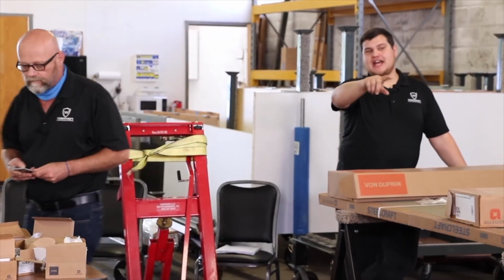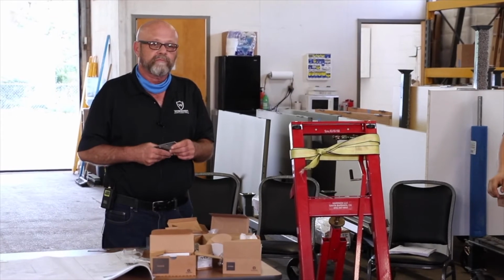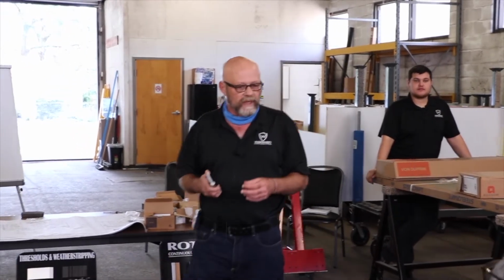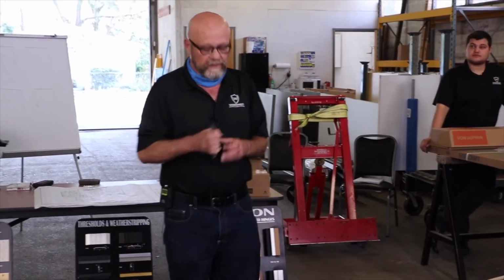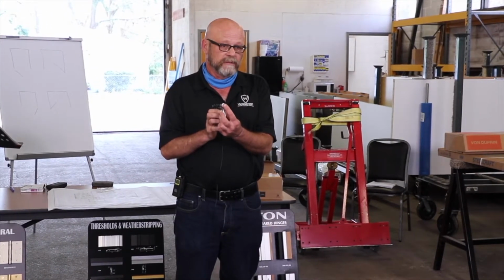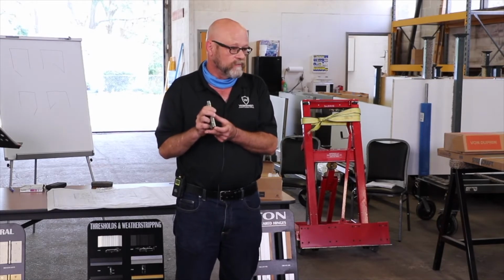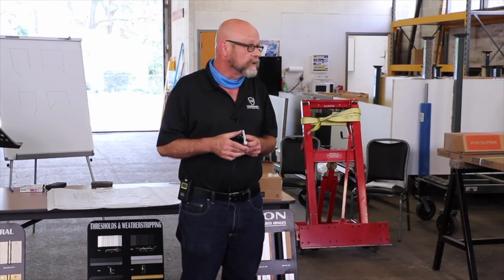And also that heavyweight hinge that you have is NRP also. It's a non-removable pin. There'll be a set screw in one of them if you open it up. Yes. You tighten that up and it keeps you from taking a screwdriver or a punch and driving the hinge pin out. I myself have tried and I've never been fortunate enough to get a door out with all the pins removed. They say, well, you know, you can break in, but I spent an hour and still couldn't get the door open.